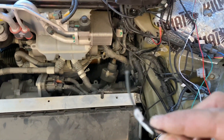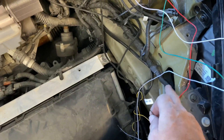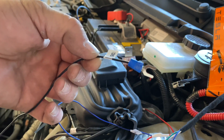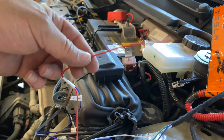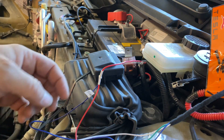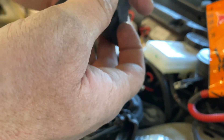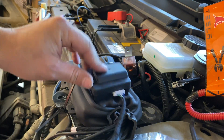The ground cable comes without anything, so I'm just going to put a clamp on it and put it here with the rest of the grounds — not directly on the battery as the instructions say, but I'd rather use a good ground point here. I've got my clamp on the wire for the ground. The positive is supposed to go into the fuse box to the electric front opener. The connector just connects easily to the box here with the control unit.